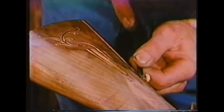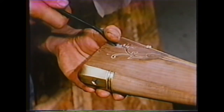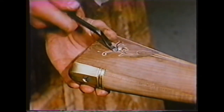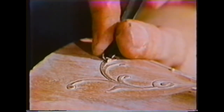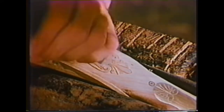A molding is cut along the lower edge of the stock to make the butt more graceful. Cutting away the background smooth and flat is the most difficult part of relief carving. In designing carving, like engraving, I try never to repeat any design exactly — I like the carving to be different from gun to gun, which makes it more interesting for me. The carving and the molding slenderize and give the gun more grace, particularly around the lock and tang. This is the most critical part of the gun — you tend to look from here back or from here forward. You have to carry your lines through this area and try to keep it from looking bulky. You can do this by having your molding lines run lengthwise and by having your wood in more than one plane.